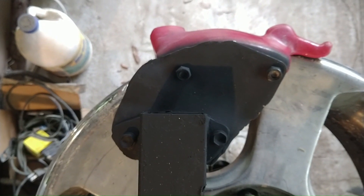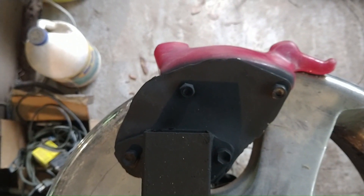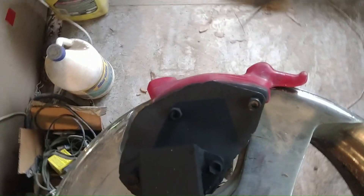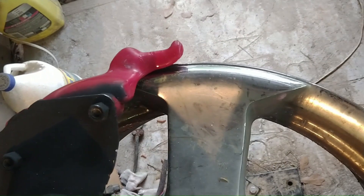As you can see, the duck head is not exactly centered. My pole has a couple of bolt holes, I have a plate with a couple of bolt holes, and I have an offset. The reason I have an offset is because that's what matches the diameter of the wheel. With your bar centered up against your wheel, you'll need your left side centered on your rim and your right side centered on your rim — that's when you know where to drill the two bolt holes.